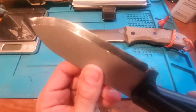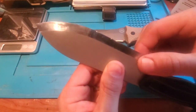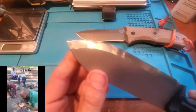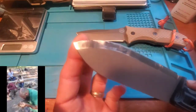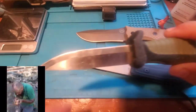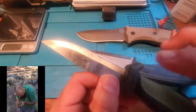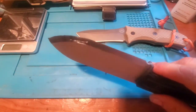There's no secondary bevel at all, so this comes to a really fine, shallow point, and I think it was easy to roll that edge when it hit something. You can also see — we were drilling with these into wood, and I knew that was going to be a bad idea for the tip. Sure enough, it busted up the very tip edge. So this knife needs a little bit of work before it's back in action. On my Mora, you can see that small secondary bevel — the light shines off it — and I think that gives a bit more strength to the edge.